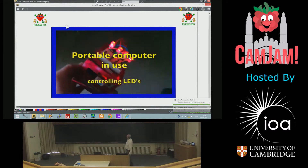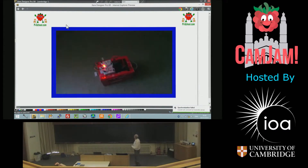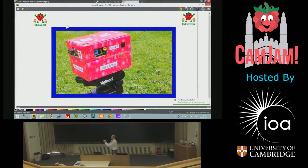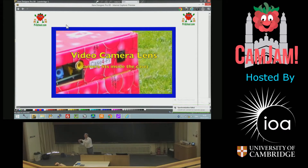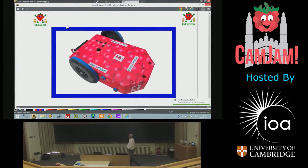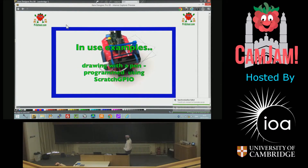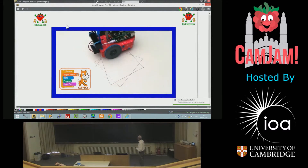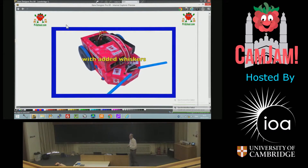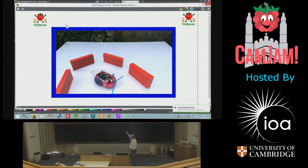There it is being a little portable computer made with two of these containers. There's another hole there — you can even put the camera in there and it becomes a camera as well, so it all fits in the same box. Going on to robots, using the same idea. The biggest problem with robots is the batteries — you need 5.2 volts for the Pi and another source for the motors.